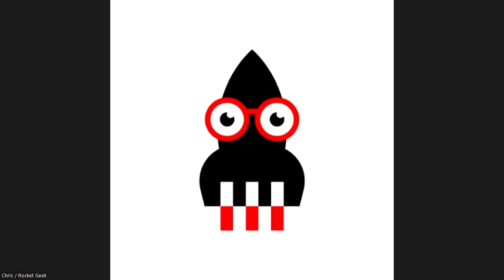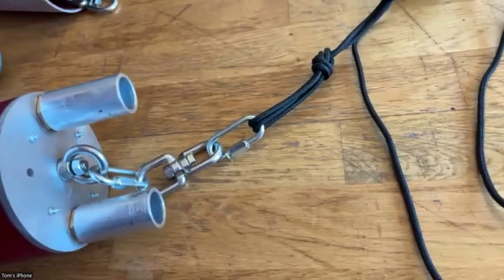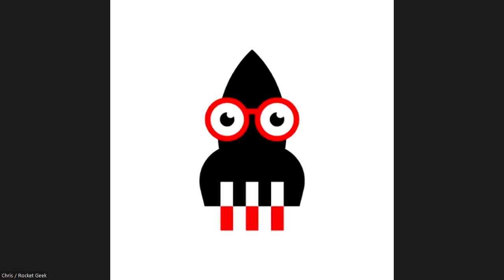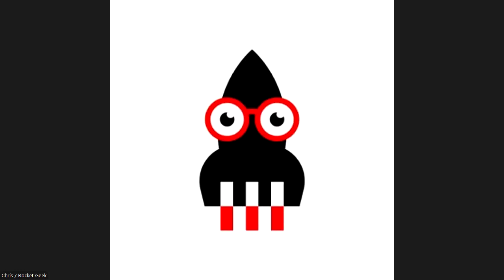That presumes what attitude, what angle of attack, like at apogee? Because the rocket doesn't go straight up and tail, right? Yeah. Can you repeat the question? Sorry. So typically the rocket goes up, and it's not going to go straight up and then tail stall and then fire your ejection charge, right? The rocket is almost guaranteed to have some forward motion, some angle of attack, that it's kind of flying horizontally, so to speak.